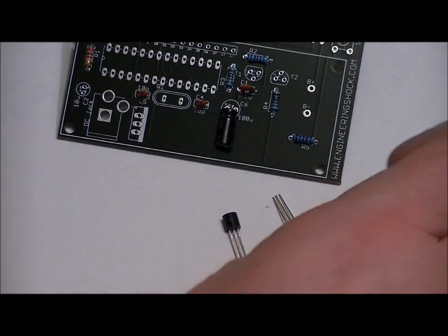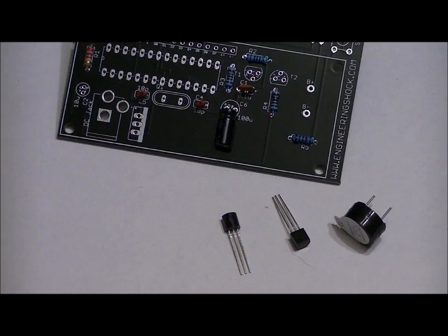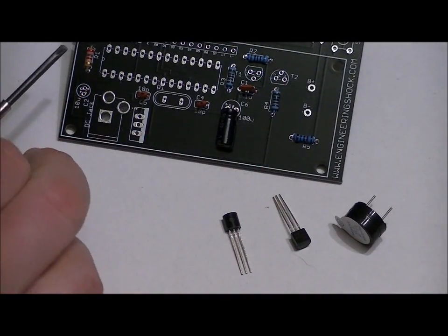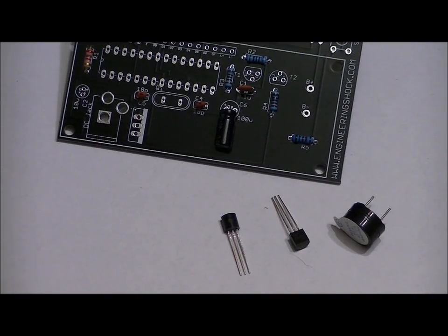The buzzer has two leads. One is very short, one is a little bit longer, and the longer pin goes in B+, shorter pin goes in B-. Much like the electrolytic capacitor, long lead is positive, short lead is negative. Now for the two transistors,